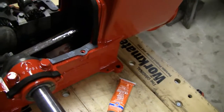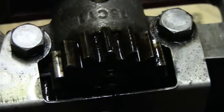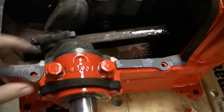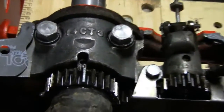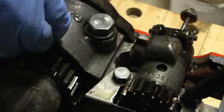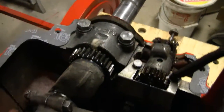We just got done oiling up some of the mechanisms. Let me take a look at them gears again - I can't get over how nice them gears are, unbelievable. We made the gaskets and gonna put them down, stick them down. These are the felt gaskets - we saved these when we took it apart. He's inserting them into these little holes here; they go to a crank felt piece. That thing gets saturated with oil and stays wet, keeping everything lubricated.